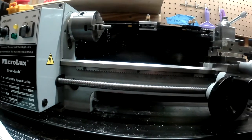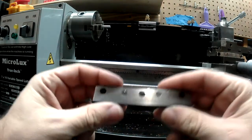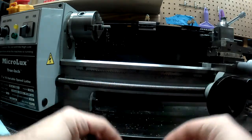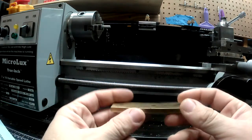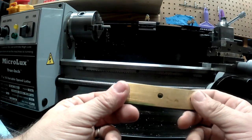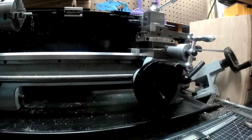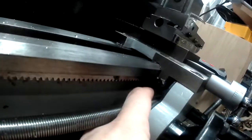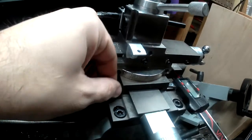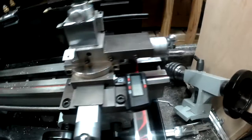So what we'd like to do here is twofold. We'd like to replace this very soft piece of mild steel or iron with a more friction-resistant piece of engraving brass. And we'd also like to move the adjustment to the top, so instead of having to come under here to do adjustments or removing the whole carriage, it would be super nice if from the top we can adjust all of the tightness.